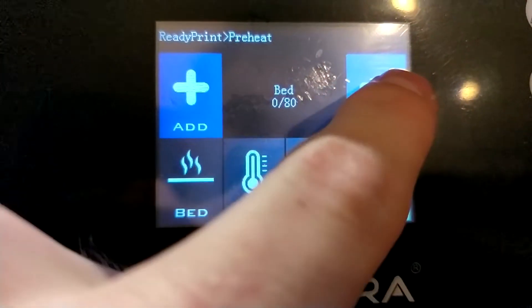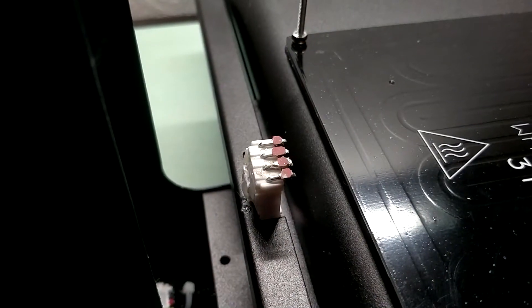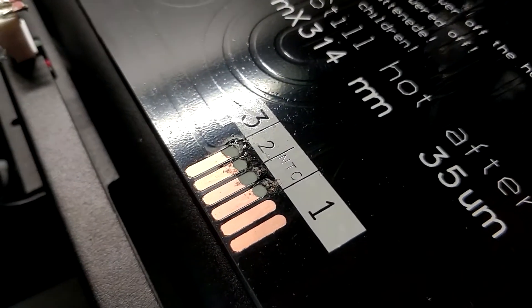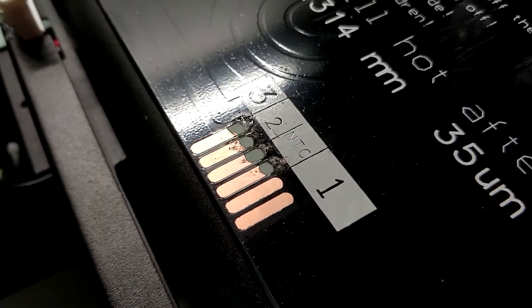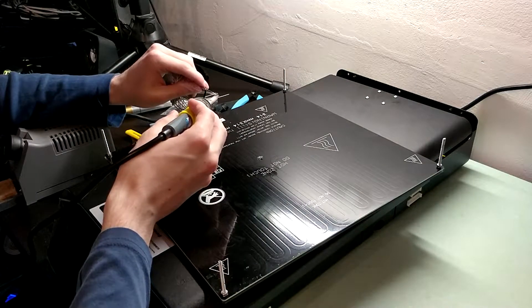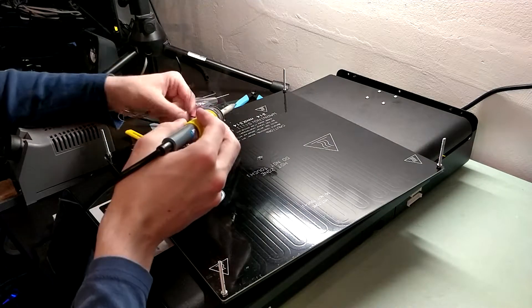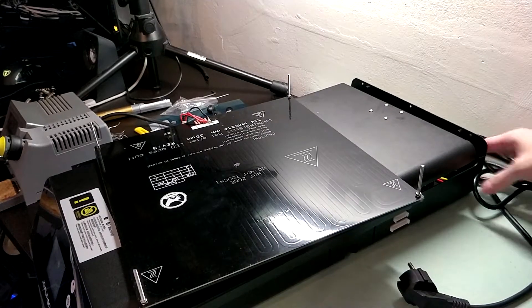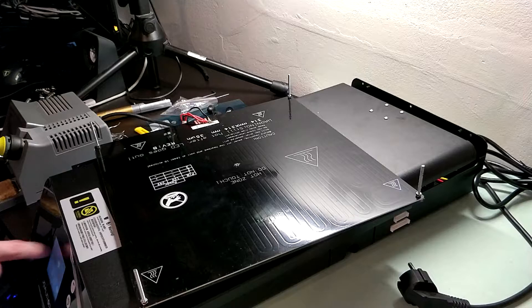However, my heated bed didn't heat up. When looking at the heat menu it always said 0 degrees Celsius, meaning not connected. I quickly realized that the heated bed connector was loose — but it wasn't just loose, it had also busted off the copper of the PCB. Furthermore, the connector was connected wrongly: the sensor was actually connected to the heating output and the heater was connected to the sensor input. I quickly scraped off the solder mask and soldered the wires directly on, correctly this time. I'm sure that if I had contacted support, I would have probably received a new heated bed.